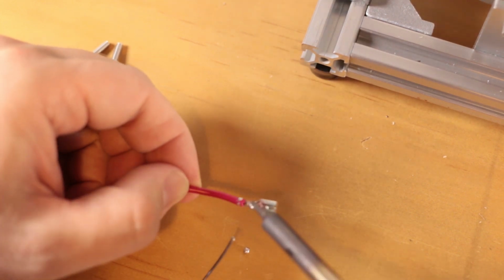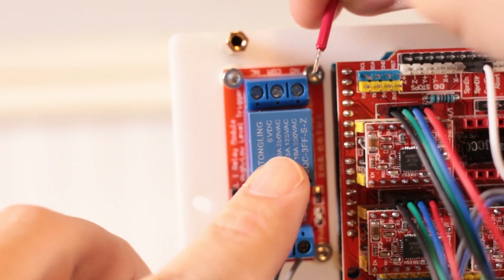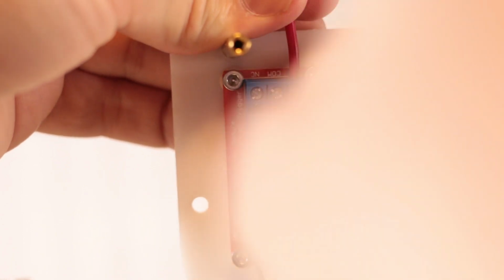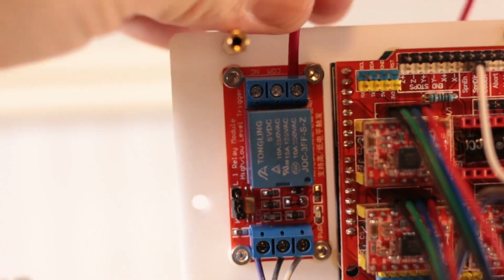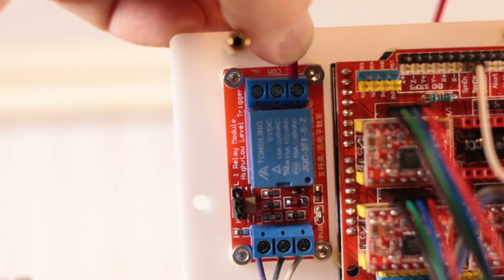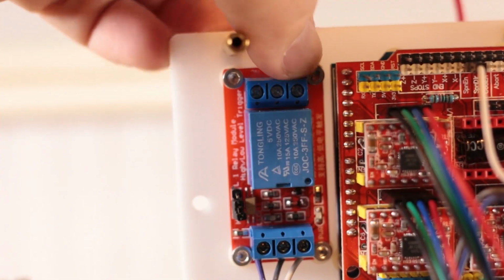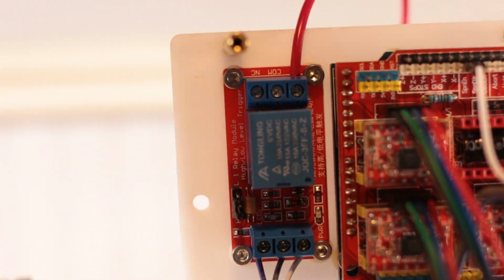There we go. You can see it sweat. You'll see it move all up in there when you get the job done. And this end here, of course it's been tinned, and now it just plugs right in. You must tin even the ends that are going into these terminal blocks, because you need to get really good bearing on that. Without the tinning, you can get a short or just not as good of a connection there. You can see one of my previous videos where I talked about the fire danger in that.